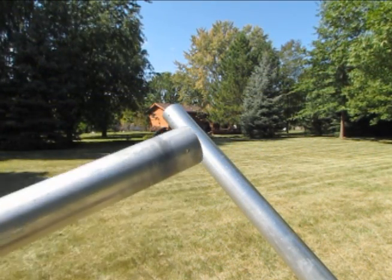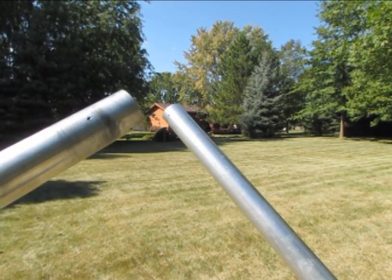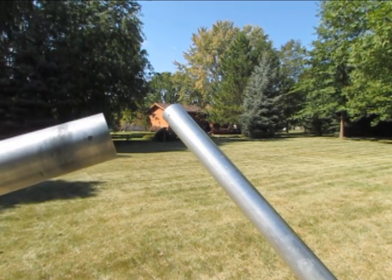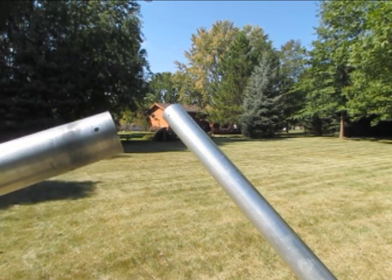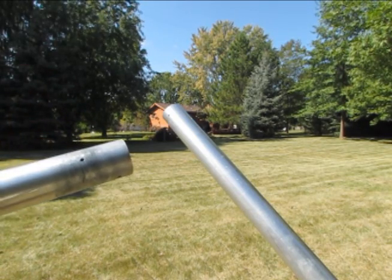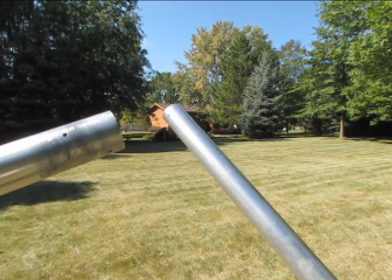I've got the next section of tubing here and added penetrox to it, wiped it down with a towel, and that's going to be used as a compound between all the aluminum joints, all of the tubing. So there are holes, as you can see, a pair of them on each tube, and those will be through-bolted with stainless steel hardware.